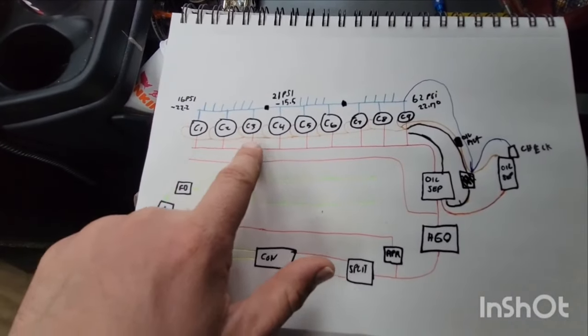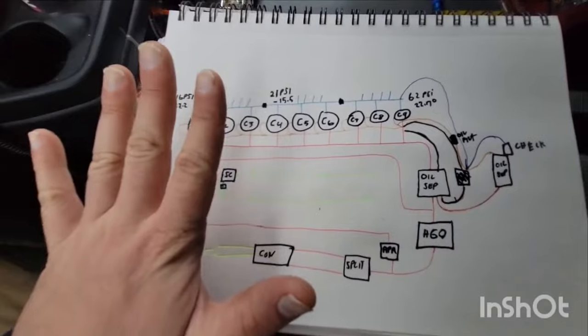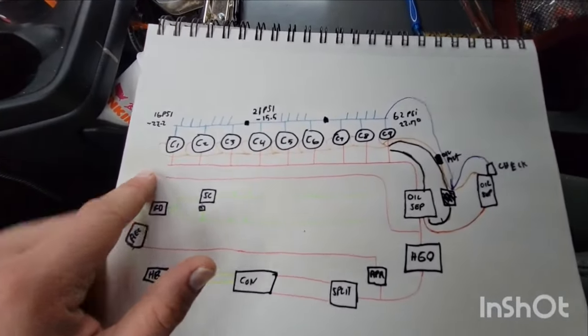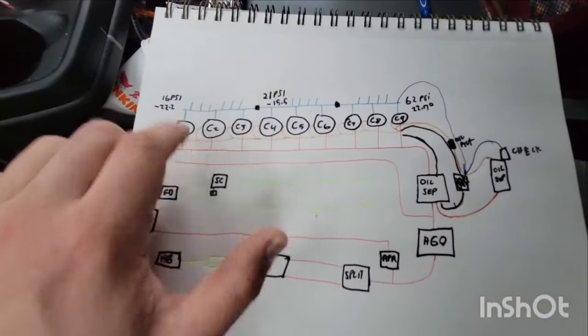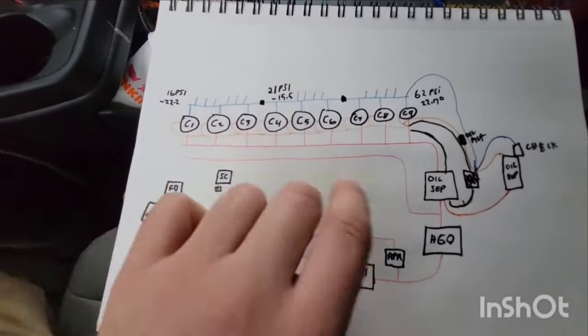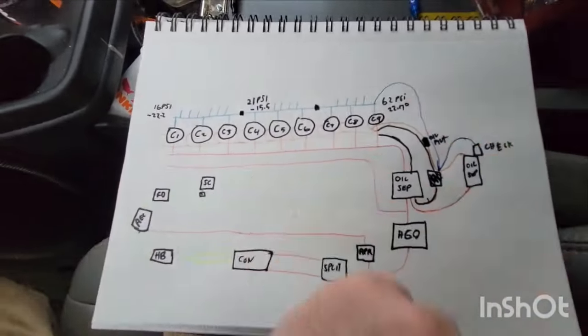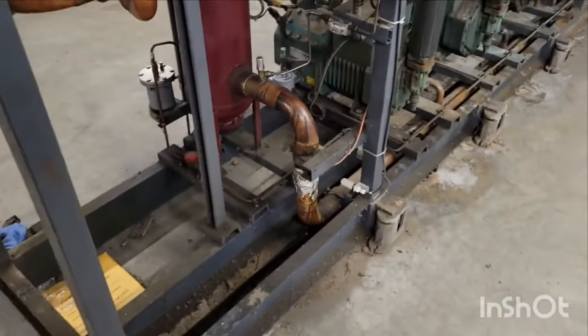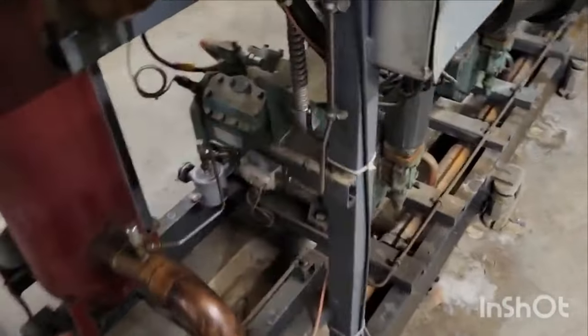So if that individual compressor is off on an oil failure and everything else checks out in the oil system and that high suction is causing it, and you need that compressor to run, that is when you would evaluate, okay, let's look at that oil screen. But let's go over and look at those two things and then we'll move on. I just wanted to throw this into the video for the rack down video.